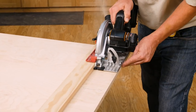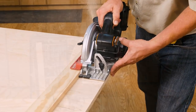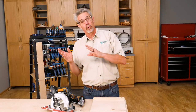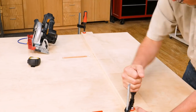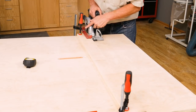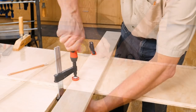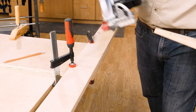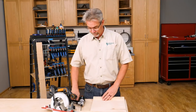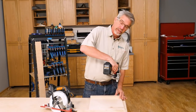If this were rough construction I'd just use the one by four. The last thing you need to do before you actually start cutting up stock for your entry bench is to cut out a square piece of plywood which will eventually become a cutoff jig. Just three simple pieces will make it. It allows you to use your exact track saw to easily cut your dimension lumber to the exact length that you want.